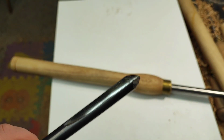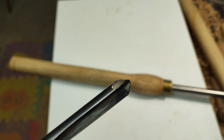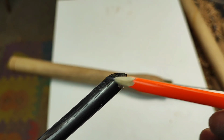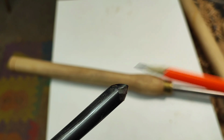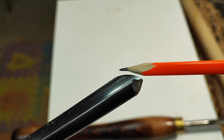And now I'm testing out the platform, which I'm going to show in the beginner series on sharpening, to do something similar to this, but on the platform, so it's much simpler. I showed this at the beginning as well, I'll show it now again. This is done with the platform, also an asymmetric grind, but due to swinging the handle and the tool around the platform, you inevitably get a much smoother curve, a flatter curve, sorry. Here you can see where I usually hold the gouge in my hand and then I can manipulate the curve, and I'll have this full curve.